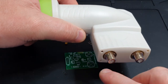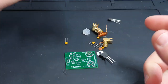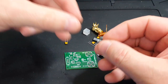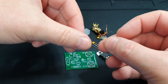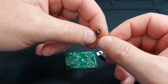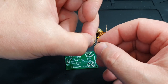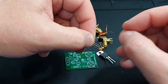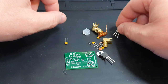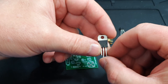The single one is 85 milliamps and the twin is about 110 milliamps draw. It is on the very edge of what this regulator here can provide, and it does get quite warm. It would be helpful if you put the little clip-on heat sink on there, so jump on eBay and find one - they simply clip on and will help no end.